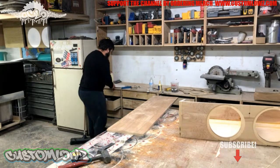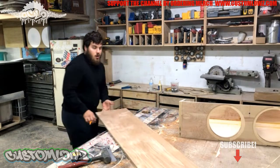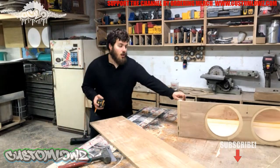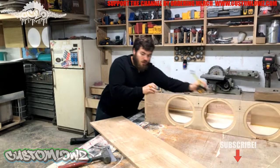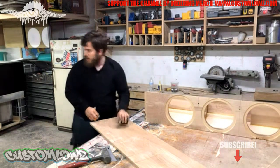Okay, look at my paperwork, see what the mounting depth is. Okay, 5 and 15/16ths. So we know our cutout needs to be at least that big, deducting the inch that we have of thickness for the baffle. So 4 and 15/16ths, we're just going to make it 5 inches.